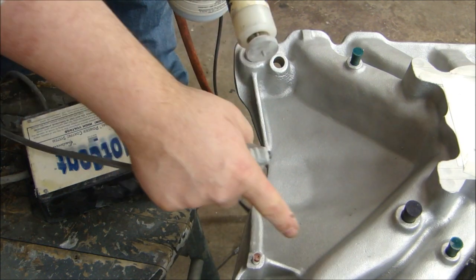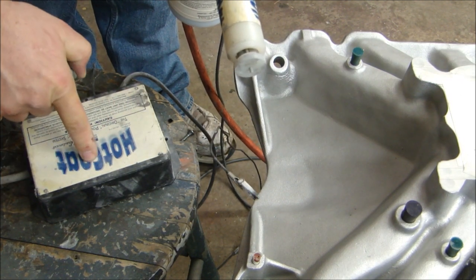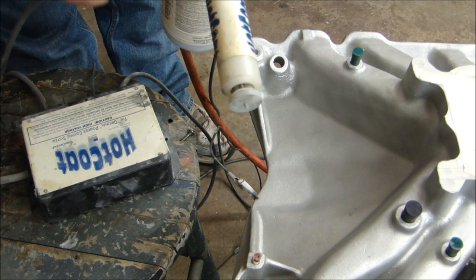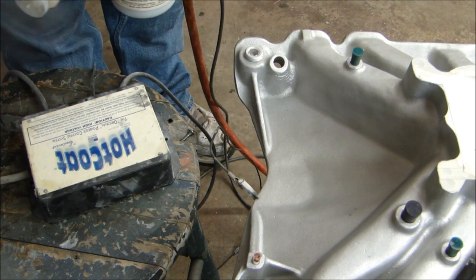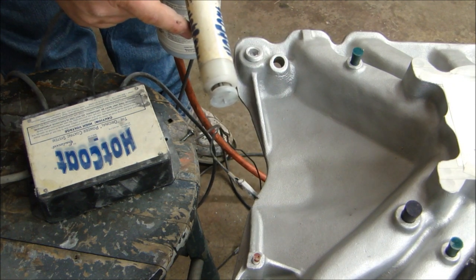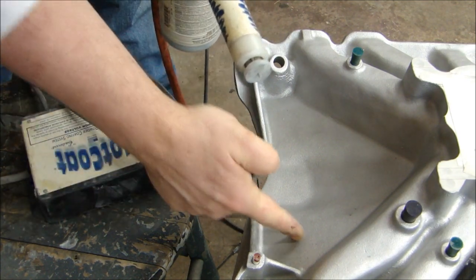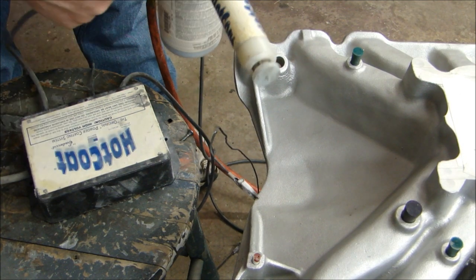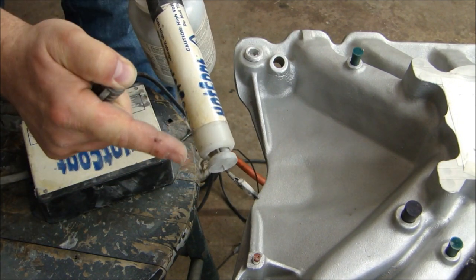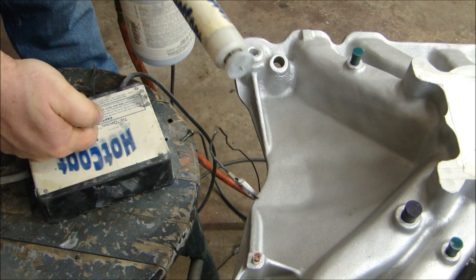I'm going to pull the trigger on my hot coat gun, and what it does is get current through here and creates high current inside this tube to charge the powder. And if you don't think it's a high charge — I'll bring it close and you can watch. If I pull it here, you'll hear a spark. See that spark? There's a lot of high voltage inside here created by this transformer. So now I pull this, I'm charging the part — creating my point charge Q. As the powder gets sucked up through the gun, it goes across those tubes in the presence of an electrical field, becomes charged with extra electrons, and is going to be drawn to the part via the electrostatic potential energy.